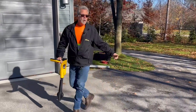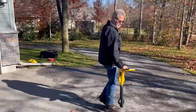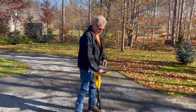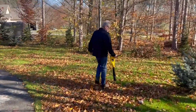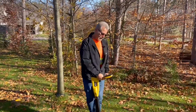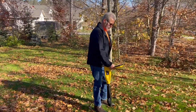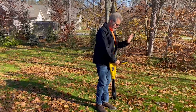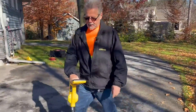This is the first step that anyone takes: hook up your transmitter, get 10 or 15 feet away, and just do a sweep across the area and see what you pick up. Here we've got something right here — I have a signal here. I'll turn my sensitivity up a little bit. Here's a conductor right here. And since I don't know where this line is, I keep sweeping and I find a second line here. Here's a line going in this direction — my meter is there, so it could easily be coming in this direction. I've got some signal here, and if I sweep back to where my first signal was, I pass over top and again I've got lots of signal.